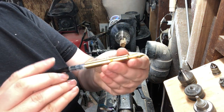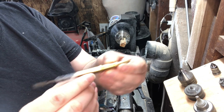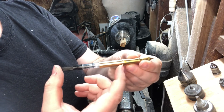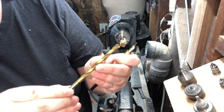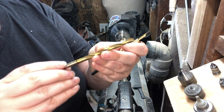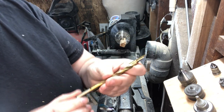Here we have the components of our fountain pen kit. The ring between the section and the inner components is what sits flush against the blank. So we're going to drill the length of the inner components at the diameter of the smallest step. We're going to use a quarter inch drill bit, which is just slightly bigger than our smallest part of the components, and drill three inches into the blank, which is just slightly over how deep we need to go.